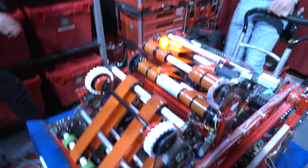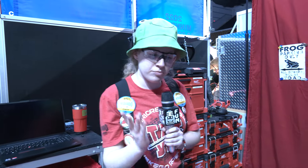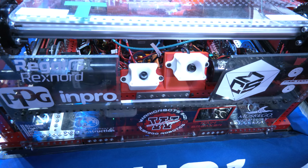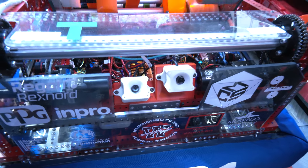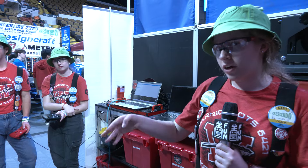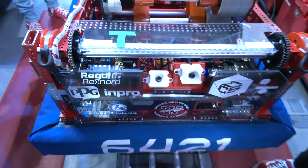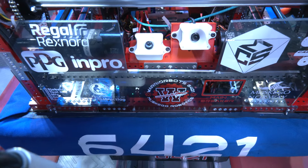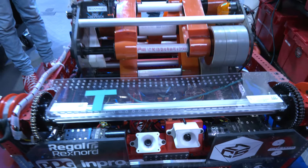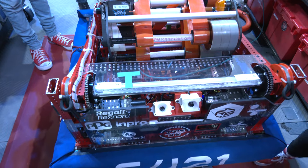Let's go into the programming and software — some really cool custom work with pathing and vision. I'll start with vision because it ties into our shooter. On the side of our robot we have two cameras: one angled upward so we can see the AprilTag above the amp even when our bumpers are fully against the field wall, and another angled out so we can see the speaker from up to our 15-foot shooting range. We put our robot at one-foot increments from the subwoofer and determined the RPM and shooter angle needed at each distance. From that we created an equation that allows us to interpolate between any point up to 15 feet away, and we also use this camera to angle and face the speaker.